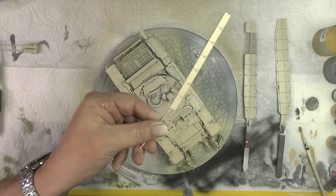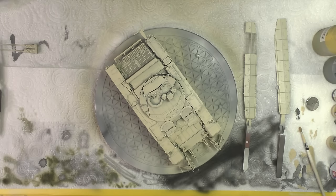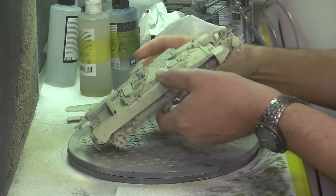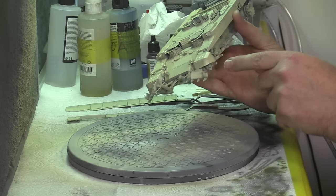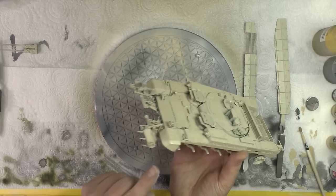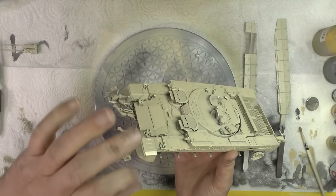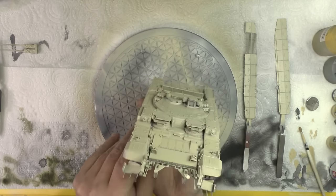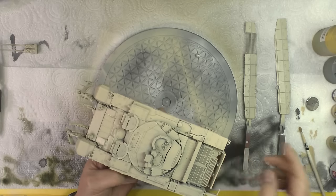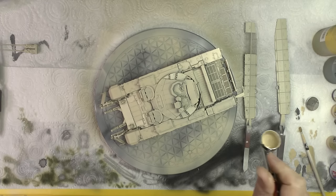Okay, and it's important when you've thinned your paint not to let it build up too much. And when I say build up, you might be able to see it. It's a good example I was gonna show you down here. Just down here, you might notice a little ring running around the front. So we've got these areas down here. It's like a little ring. What it is, the paint has naturally sagged down in that area, so it's giving us a more sort of wet look, if you like, although it's not wet, it's actually all dry. So this is technically now thick paint.